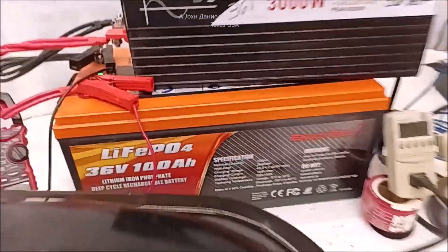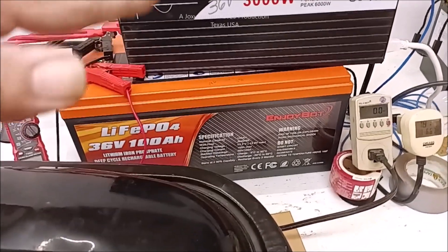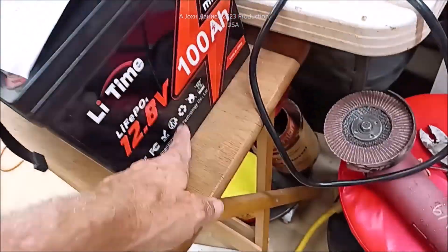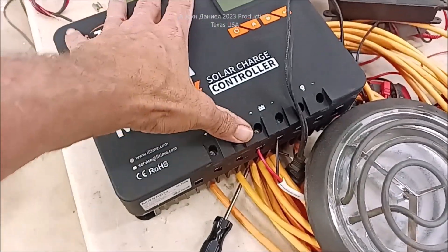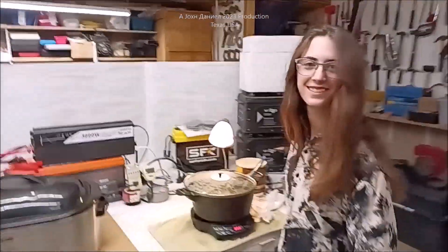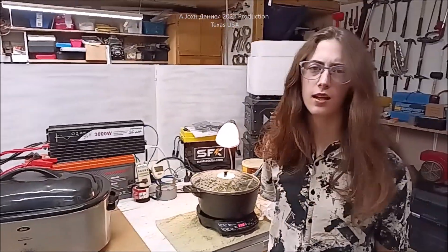The thing we figured out is that this battery was pulling over 105 amp-hours at 36 volts, but the battery is saving itself. They have to warranty these for a long time when they sell to golf cart companies, so they build it so you can't quite reach 100% and can't quite reach 0%. If you set a lithium battery to go from zero to 100% and shut off hard at both ends, that shortens the hell out of its life. This solar charge controller can handle 12, 24, 36, and 48 volts — it's a miracle machine.